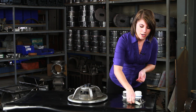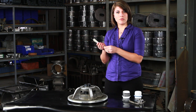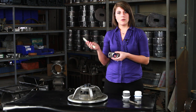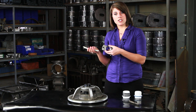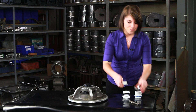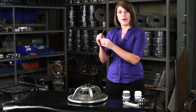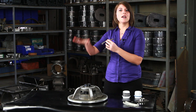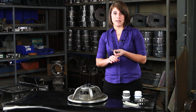With the packing gland you have roughly three rows of packing and you have your pusher. As the packing will wear you have to keep adjusting the shaft seal assembly, you have to keep adding more packing and then adjusting the pusher. After it wears, this is what it looks like — it's packed down, the material is going to creep through there, it's going to wear the shaft, your shaft seal assembly and your bearing.